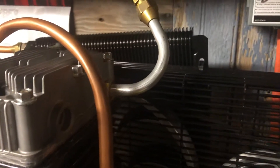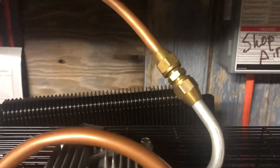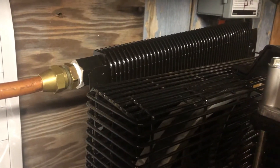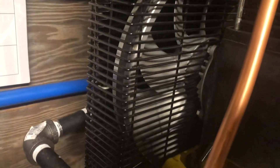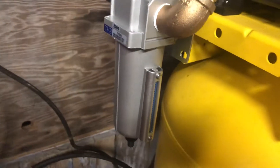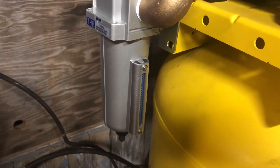It's got aluminum tubing coming off it — I flared it, put a flare fitting there, went to half-inch copper, which I have a lot of setup for. We went to an oil cooler — I linked the part number on Amazon in my first video. Then came out half-inch black iron to this water separator, which has got an automatic drain. We'll see how that works — I have no experience with it. Then it goes up the line, over the head, and into the tank.